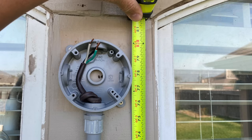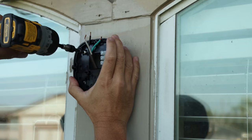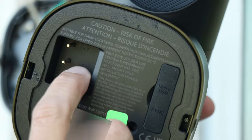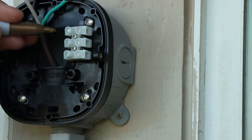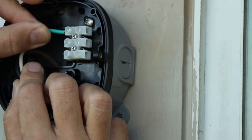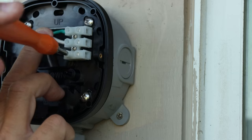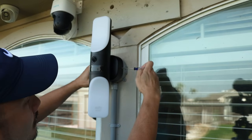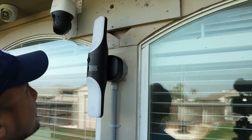For testing, I'm installing this in a junction box 78 inches high. First, turn off power to the light fixture you are going to replace. Put on the mounting bracket making sure the right side is up, and screw it in using the included mounting screws. Eufy placed the wire labels on the light itself — G for ground, N for neutral or white wire, and L for live or black wire. The markings on the bracket are hard to see, so I'll mark with a sharpie: top is ground, middle is neutral, bottom is live. Slide in the green or bare copper wire on top, neutral white wire in the middle, and black live wire on the bottom, tightening each screw. Do a tug test to make sure they are tight. Line up the pins, push the wall light into the bracket, and secure it using the included small machine screws — one on each side. Once installed, you can adjust the camera's position up to 30 degrees side to side, but you cannot tilt it up or down. Then turn the power back on.